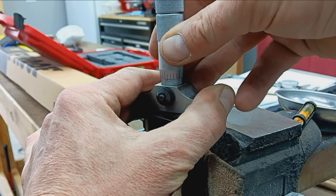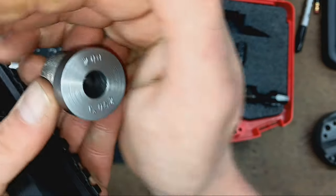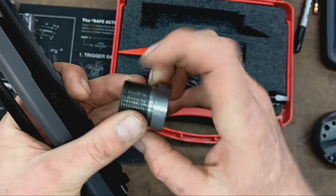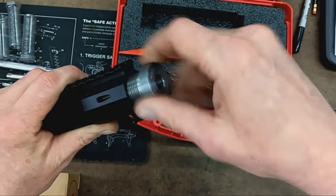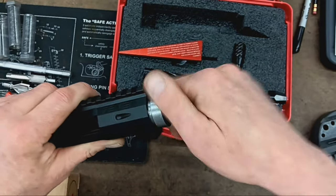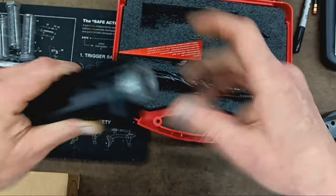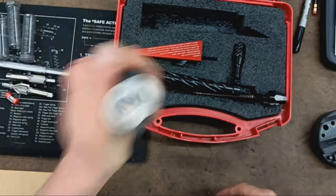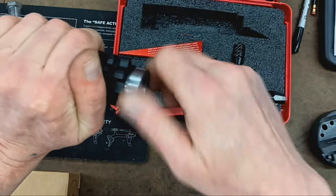This is a typical Remington 700 style barrel tenon. So your 1.062 or 1 1/16 diameter and 16 thread per inch thread pitch is what you're gonna want. And this stub is made to a very precise dimension. So as you can hear, I'm not struggling, but this is certainly not loose. You know, I'm not muting this. There's no rattling, no play really back and forth, but I can still get this thing all the way in by hand.